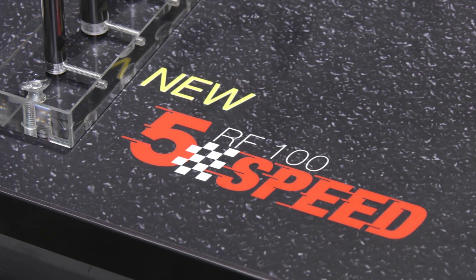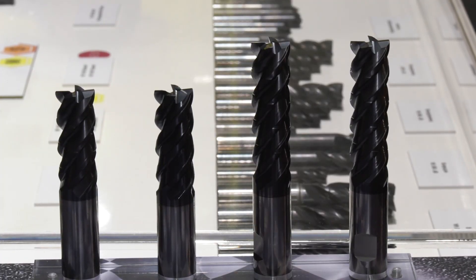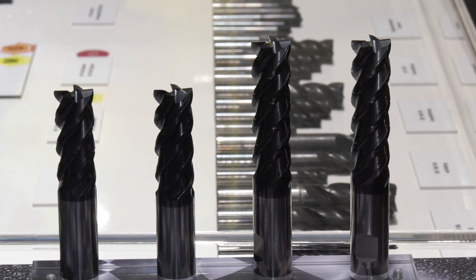With the limited AE we take on the side: with the four flute tool, maximum 15% of the tool diameter; with five flutes, up to 10% of the diameter; and with seven flutes, up to 8%. These are the rules and limits we've written in our catalogue to give the customer the information for good application.